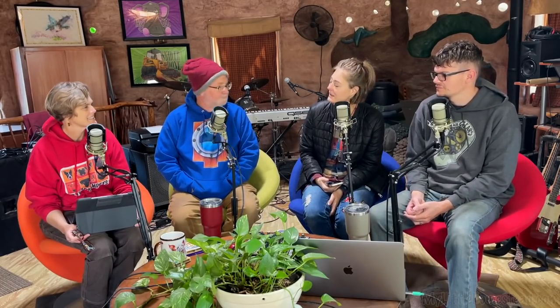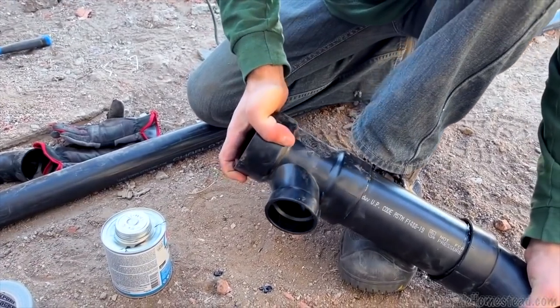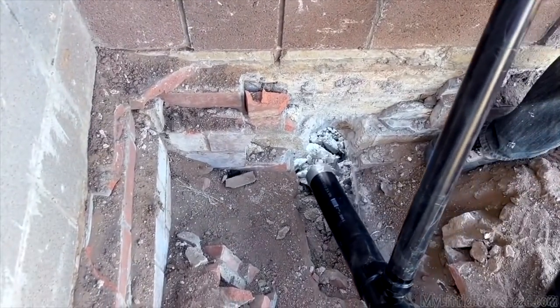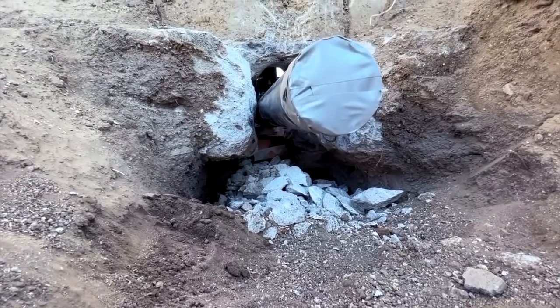In the weekly peak this week, you guys put in a bunch of piping, tubing, and utilities — your power and your stubbed in. Paul Ogia says you might want to run a piece of rope inside your utility pipe next time. If you ever decide you want to run something else in the pipe, such as airline or electrical, you can just tie on and pull it through. Just kind of an interesting thought.